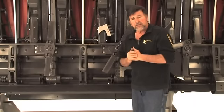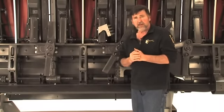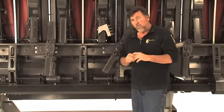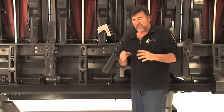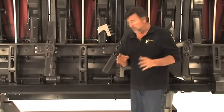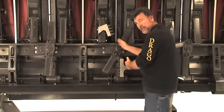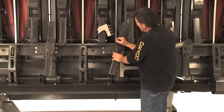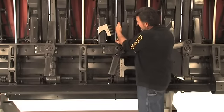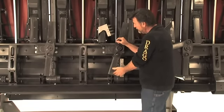Our latest option that we are just releasing is called the Double Cut Stationary Knife. Why we're able to do this option is because of the unique position of the chopper gearbox on the Drago. Remember, it's centrally located straight behind the stalk roller. That means as the front blade is swinging, it gets a chance to chop, and we get a second chance to chop on the rear swing.